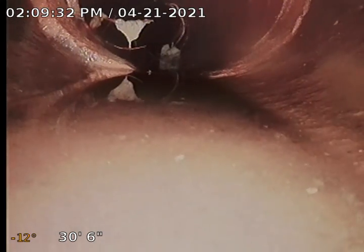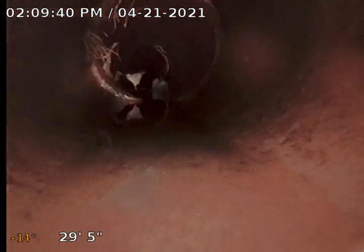Okay, I've located that inside the yard, about 7 feet deep. That's where we're going from 4-inch to 6-inch diameter sewer. So we were at 44, 45 feet. 44 feet when we joined this line. We're back at 30 now, so 14 feet of personal 6-inch sewer before we hit the neighbor's connection point.